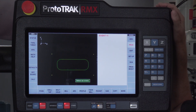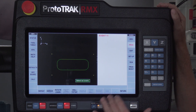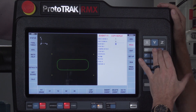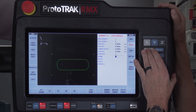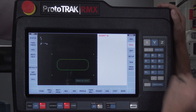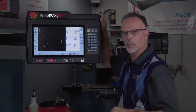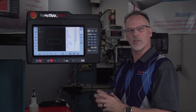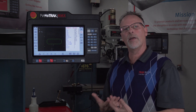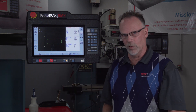Now I've got two fixtures, though I don't see them yet because I haven't set up the fixture offsets. I'll do that same process one more time — repeat from event one to event five, no offsets, one repeat, tool number one, fixture number three. Swiping backwards, you'll see fixture number three. So now I've got three parts set up in three different fixtures, but all my fixtures have the same offset, therefore the parts are on top of one another — that's why you only see one.